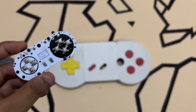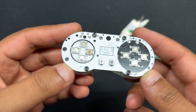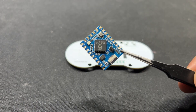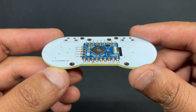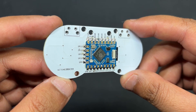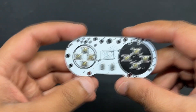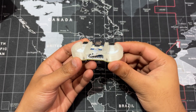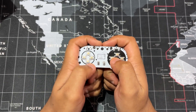For version 2, I intended to reduce its size to something less than the palm of a hand while maintaining functionality. For the smaller version, I utilized the RP2040 Tiny Mini Development Board, which is a module version of the Raspberry Pi Pico. This RP2040 Tiny module was mounted on the controller-shaped PCB with small SMD tactile buttons on one side and the RP2040 controller board on the other. To improve the controller's grip, I added an enclosure attached to the bottom side of the PCB, making it comfortable to hold.